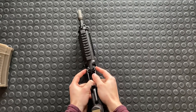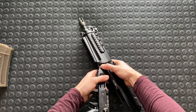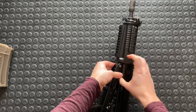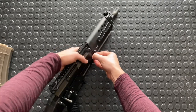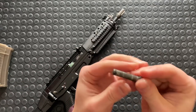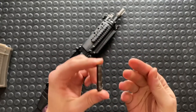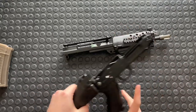A little stickier, this one. I might need the help of a hammer to get that guy out. Very sticky. One of these pins is sticking on me for some reason — that's why. There we go — that's kind of odd, it shouldn't do that. That's why it was getting stuck in there. Completely out. And for whatever reason, this guy on the right isn't actuating when I do this, so I've got a bad pin there. I'm going to have to possibly get a replacement. Anyways, now we have our upper and lower swapped apart.